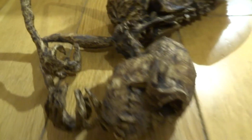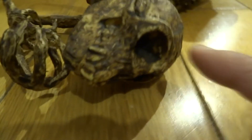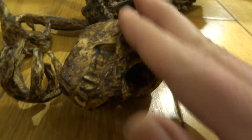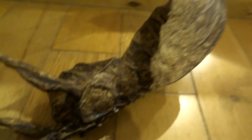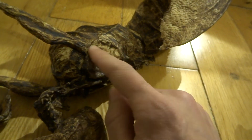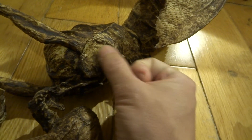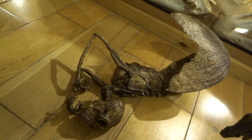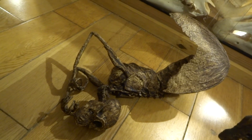So you let that all dry, and then to get this really aged effect I just use brown wax — just furniture wax that you buy for wood — and you just literally rub it in with a cloth. It wouldn't be any good if you then wanted to paint it afterwards, because once it's waxy the paint won't adhere to it very well. But if you just want to literally rub the wax in and have a quick finish, that makes it look really quite aged. That's a really good technique.